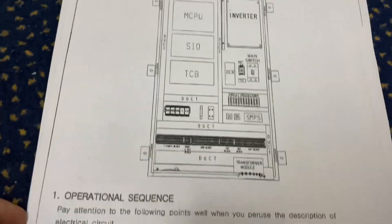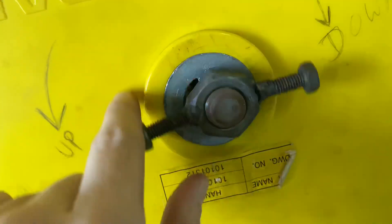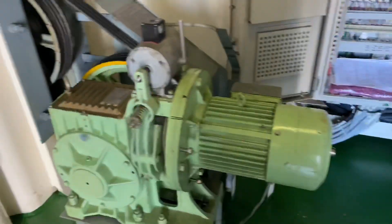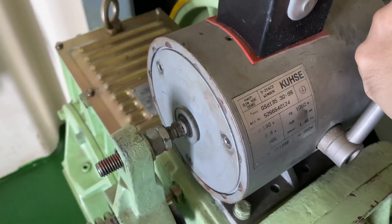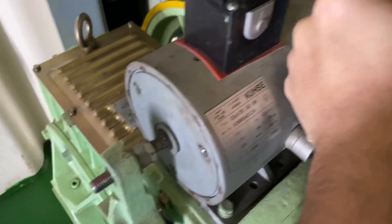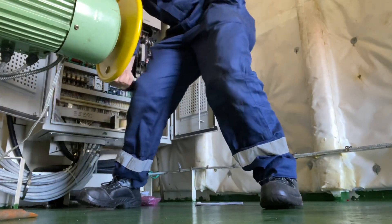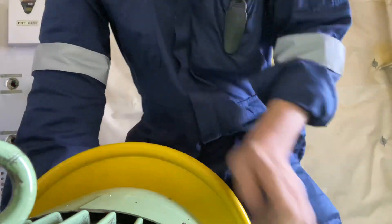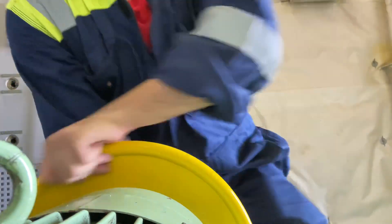Since the manual didn't give us anything, I decided to switch off the control panel and manually lower the car from the sixth deck to the fifth deck. To do this, we use a manual wheel to turn the motor. We also need to manually release the brake — there is a designated handle for releasing the brake. This must be done while the control panel is off, so that once the car reaches the fifth deck we will have a matched floor.